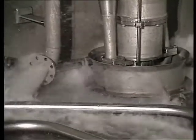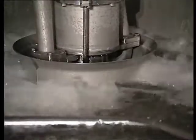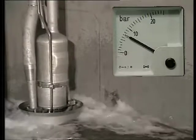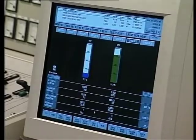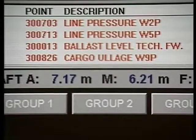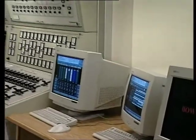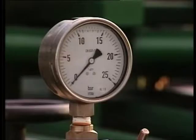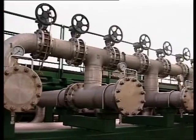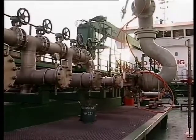If the ship is not equipped with a drop line, follow the same procedure except for operation of the drop line valve. Most ships today have an integrated computer system which takes care of control and monitoring of all activities within the cargo tank section, such as pump capacity control, valve control, temperature and ullage control. If the loading has been stopped and the cargo valves are closed, it's important to restart the loading by following the same procedure as described earlier.